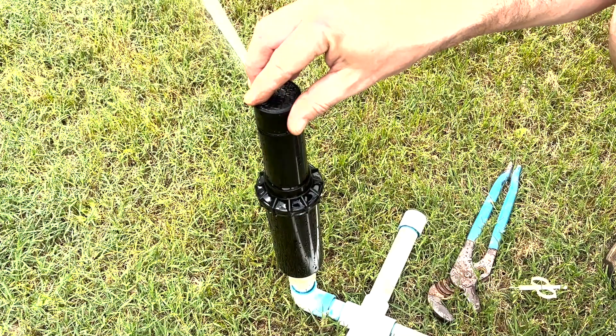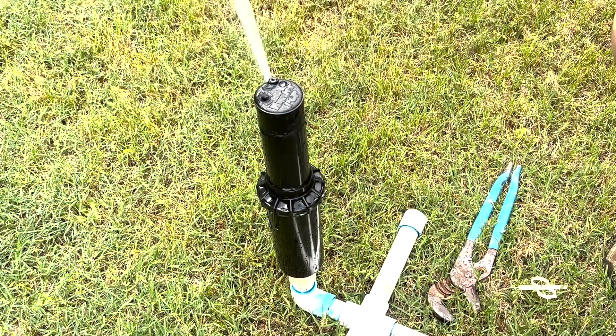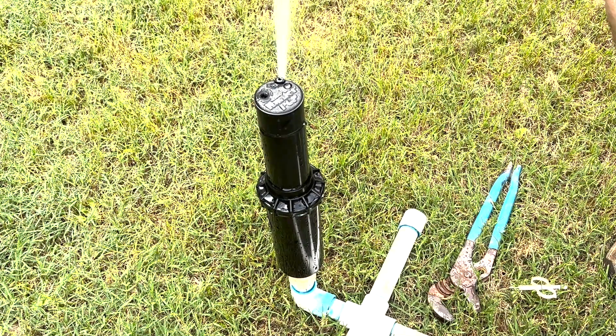For the fine-tune adjustment, I generally turn it about 75% of its travel, let the gears engage, and then carry it over to the limit. You're going to hear it click or just see it stop and then reverse path, and then you can see exactly where that limit is instead of turning it with your hand.